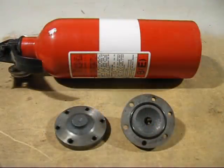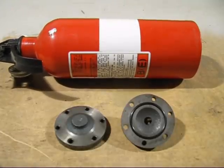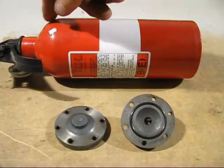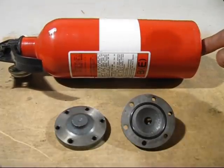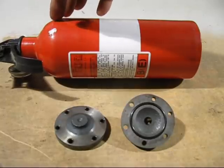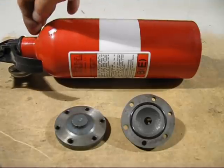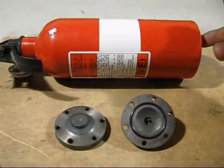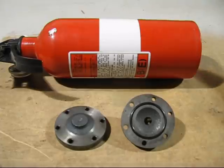You're probably wondering why the fire extinguisher cylinder is there in the video — well there's a very good reason. You'll notice it's got a hemispherical end, but this end is flat. When you have a hemispherical cylinder, the pressure is pushing in all those different directions when it's pressurised. But this one here — it's flat — it's pushing just that way, giving a lot of pressure on there.